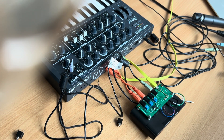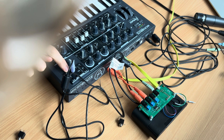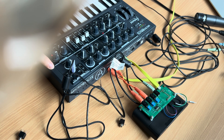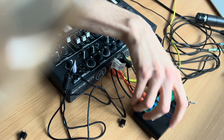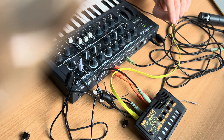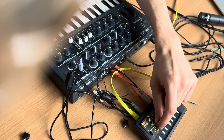The last feature I want to show off is the internal LFO routing out and being used by something else. I connected the LFO output of the Monotron into the filter input of the MicroBrute — the sounds you're now hearing are produced by the MicroBrute, just to demonstrate the effect of the Korg Monotron's LFO on the MicroBrute's filter. The interval knob is just an internal resistor and doesn't affect the output signal of the LFO, so the LFO amount is set coming from the Monotron.